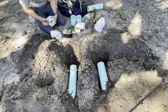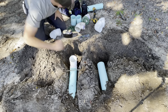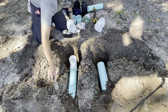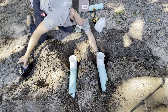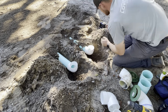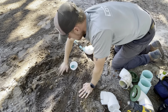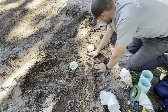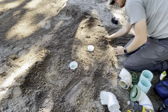You're going to see that I'm writing on these pop-ups — I'm writing 'no glue.' I'm doing that for the contractor that comes after me installing the rain garden, so when he uncovers these he knows there's no glue on them and he doesn't have to cut them — he can just pull them off. It's just one little extra thing I do for my customers and the contractors that come after me. Making sure the pop-ups are nice and level, and I'm going to pull one up here a little bit just to make sure it's level with the other one — it was about half an inch to an inch below. I want them to appear the exact same height so the next guy can easily adapt these to a six-inch pipe or a Y sanitary tee, whatever he decides.